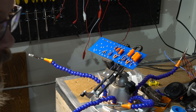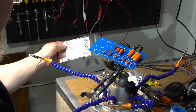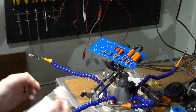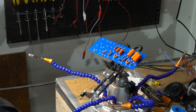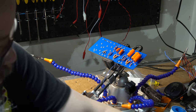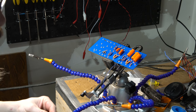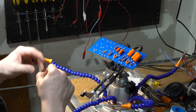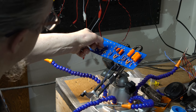Then we need a 24K that we'll cut across back here, which seems, where am I, 24, there it is right here. Is this guy. We'll double check that in a second. As I've shown before, I always double check these to make sure that I didn't get a weird value in here. 24K, all right. And that's gonna go in here. Like this.